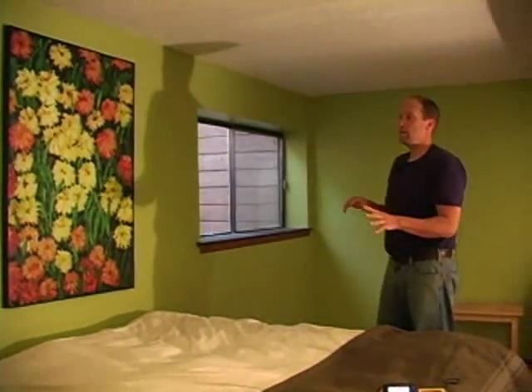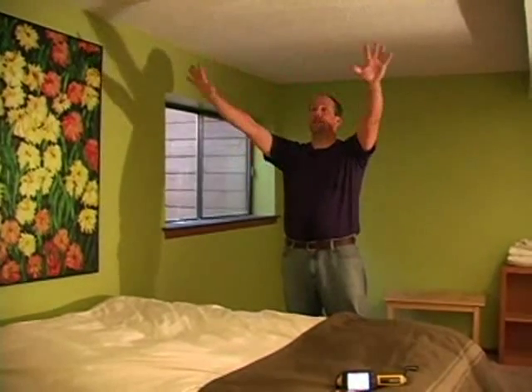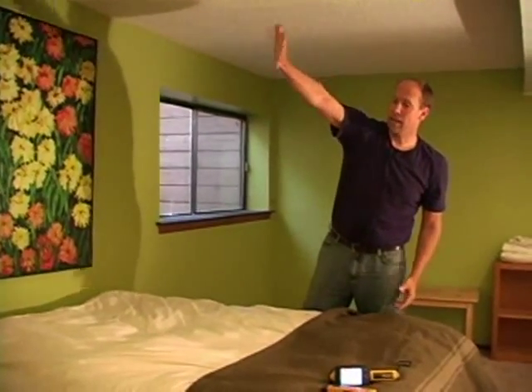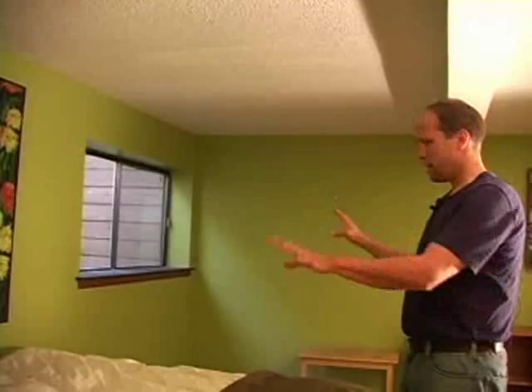We'll go back up outside, but we realized that we're partially underneath the deck. Outside there's a deck — when you go out the rear slider door, you walk out onto the deck, which is above this finished area. It's not covered, so when you see an exterior deck that's not covered, it has a flat roof under it. You have to be concerned about what's underneath the deck and underneath that roof — and it's this bedroom ceiling. Doing a visual inspection, you have to orient yourself and figure out the key areas to inspect. This is the one critical area underneath this deck.